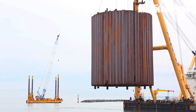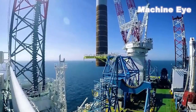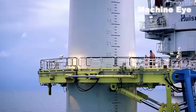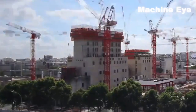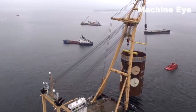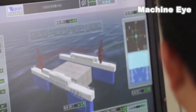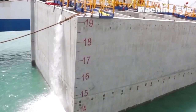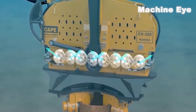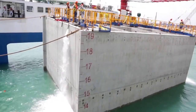The second method is the piling method, which is mainly suitable for construction in deep water areas. When the Chinese construction team built the Hong Kong-Zhuhai-Macao Bridge, the average water depth of the piling area reached 37 meters, which is equivalent to the height of a 12-story building. Piling boats were used, and engineers first explored the rock structure of the seabed, then designed the corresponding piles, and drove more than 90-meter bridge piles into the rock layer of the seabed by piling and loading. The reason why the piles are so deep is mainly for the stability of the bridge.